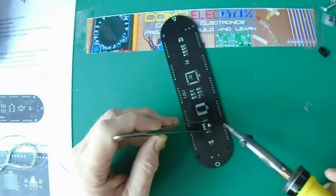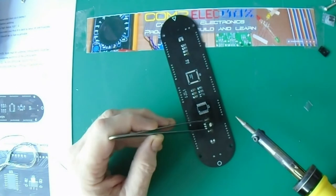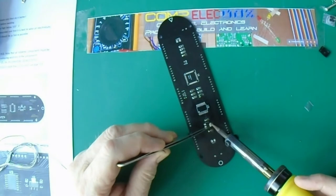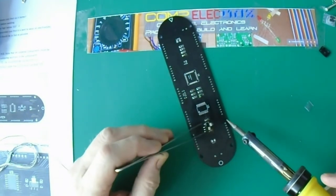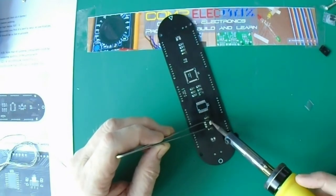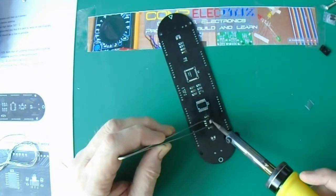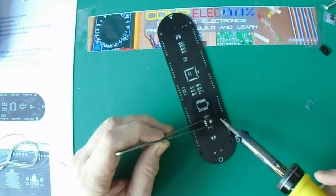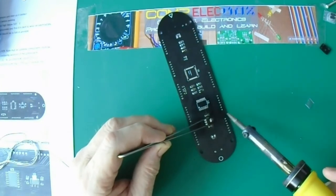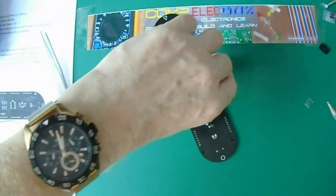While I was soldering that big tag, I'm trying to make sure that the pins line up on the other side, and now it's floating in mid air. Because it's a big tag there's a lot more thermal inertia, so it stays hotter longer - it takes longer for the solder to set as well. It's really a good idea to count to about five before you let go.